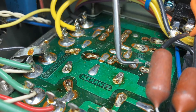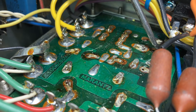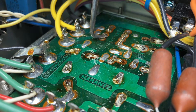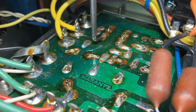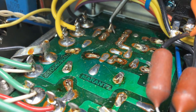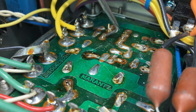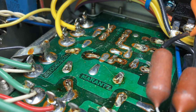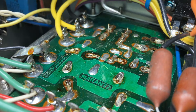Some of those guys were like, I soldered that in and nobody's gonna take it out — ever. So you just have to come over here and start working on straightening these pins. Some people like to use a little flat blade screwdriver to get underneath, and that's probably what I might move to because this isn't working so well. Might have to get the solder wick under that one a little better.